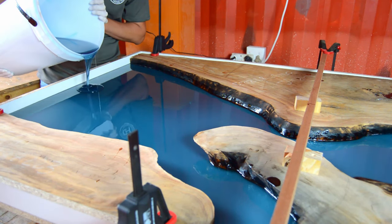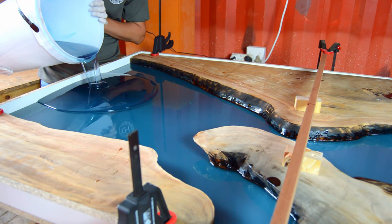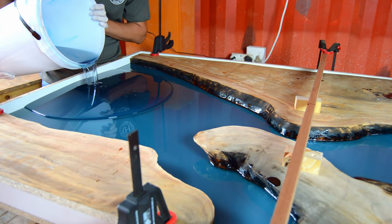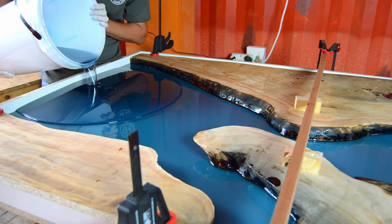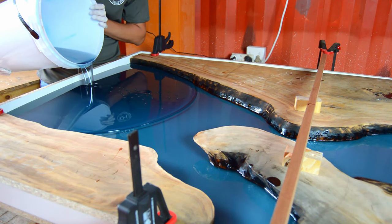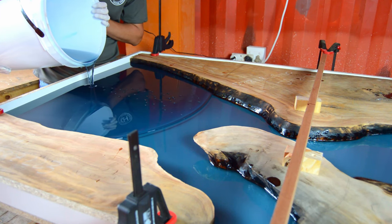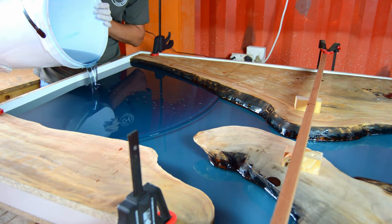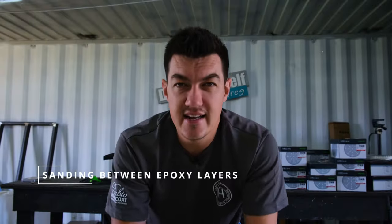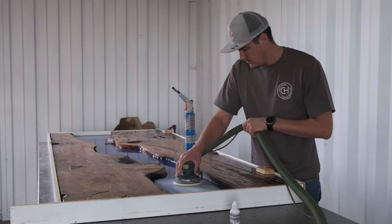When we pour a table, we go over it with a gas flame gun. Once done with a section, we wait around 10 to 20 minutes, then come back with the gas flame gun over the same spots again. You will see most of the air bubbles are released once you put the flame on the epoxy.